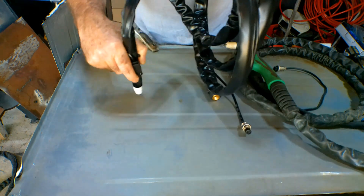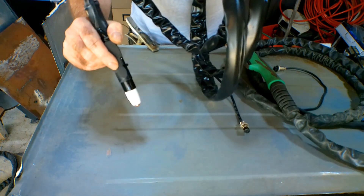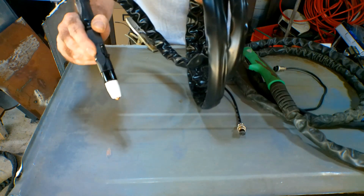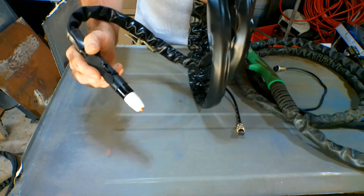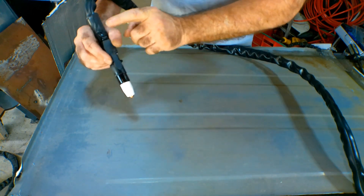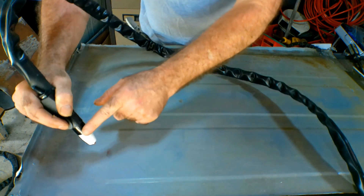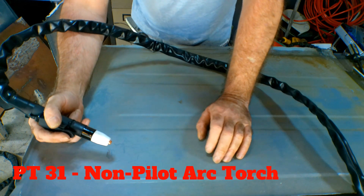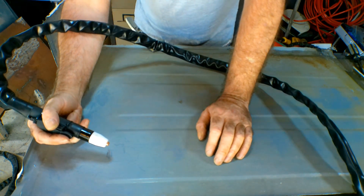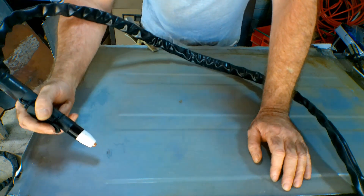You can mount it without any special brackets, and it cuts fine. But remember, if you're using this torch you can only use it on a non-pilot arc machine, because this is a touch torch — you have to touch it before it ignites, and sometimes that's not ideal for CNC. I have seen some people using touch torches for CNC anyway. If you're using this for CNC, you'll take the switch off and use the switch wiring to connect into your computer box. Let's plug it in and see how it works.